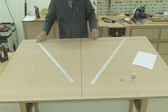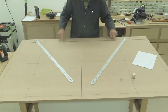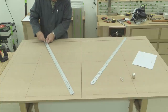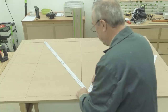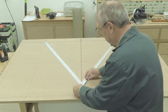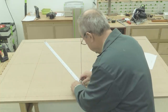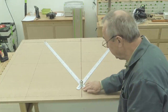Now for the isometric holes, we're going to have 10, 10 and 10. We've already got the 10 drilled up here, so I'm going to put this pin through the 0 here and into that hole, and in that hole, that's properly in. We've got to get the two 10s lined up. In order to do that, we're going to use the 3mm drill guide with the larger boss. So into that one, into that one. Check that it's in by trying to move the bottom one.